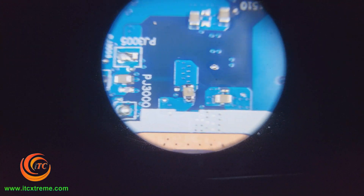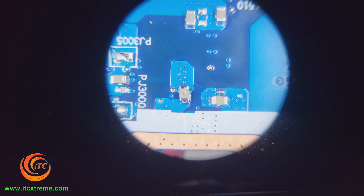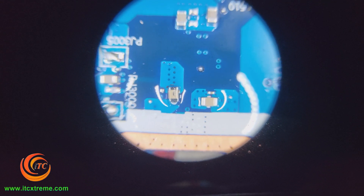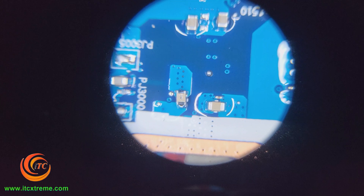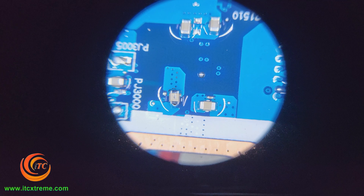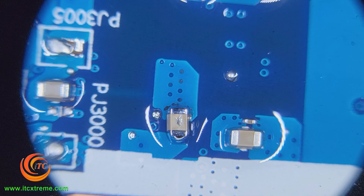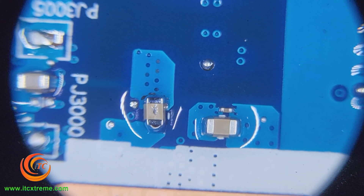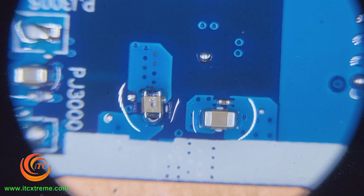Let's move on to this area — there was an issue here somewhere. I think a capacitor has actually failed here; that's the area I believe. Let's turn the power supply back on. Yes — it's a capacitor that's failed and you can see in the middle, just about make out — look at that, it's got a hole in the middle. My guess is this capacitor is on the 19 volt rail, and it's shorted, which is why it's pulling down the 19 volt rail immediately.